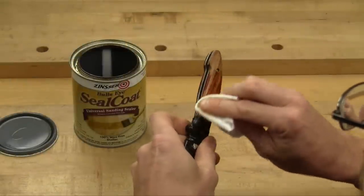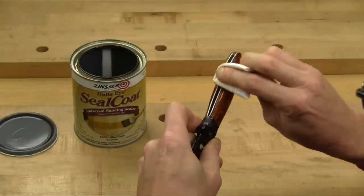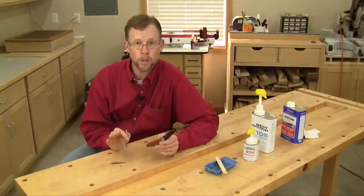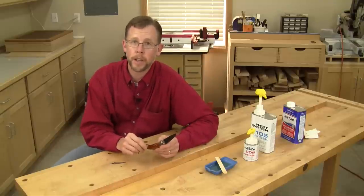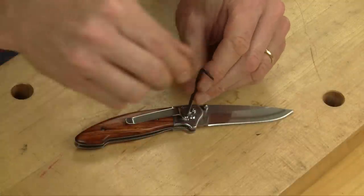When you're satisfied with your sanding, go ahead and apply finish to the scales. I started with a coat of de-waxed shellac to seal the oily cocobolo, then followed with two coats of oil-based poly. After it thoroughly dried, I buffed the finish to a shine on a cloth wheel in the drill press. After your scales are polished, you're ready for final assembly. You could just screw them on, but I'm using a little epoxy to make sure the scales will never come loose. If you go that route, use some acetone to clean off the metal liners to make sure there's no manufacturing residue on the metal. After that, screw on the belt clip and your knife is done. So there you have it — a keepsake project that's as practical and fun to make as it is beautiful. Check out all four of these custom knife kits from rockler.com and thanks for watching.